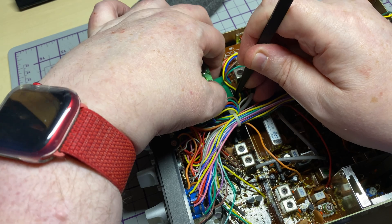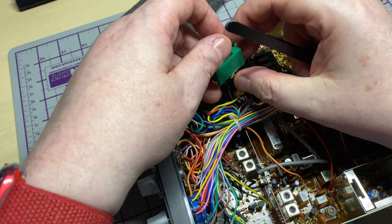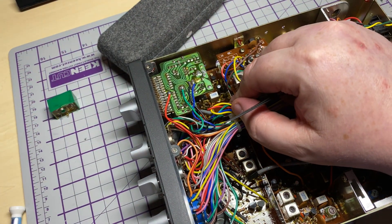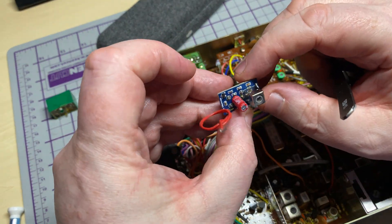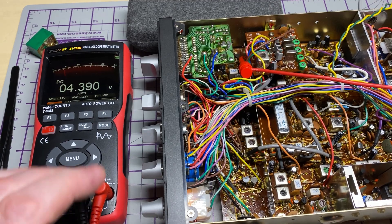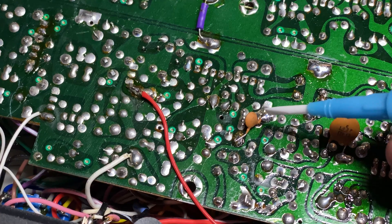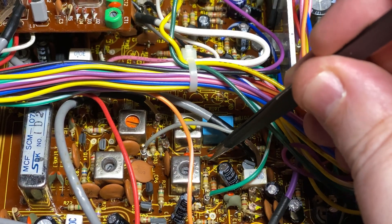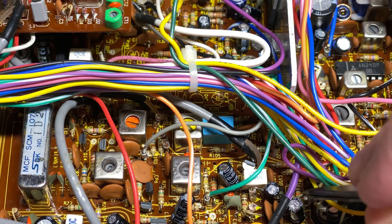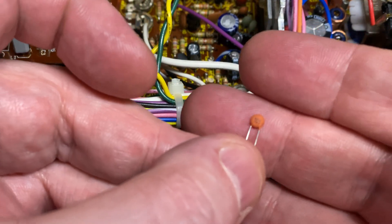The next job is replacing the VCO with a voltage-fed unit to improve stability. We could have just fitted a regulator to this but these VCOs have them built on, so we'll replace it and put one of these units in. Just quickly checking the VCO voltage across the bands and everything's fine. We've also added capacitance for improved audio and removed C99, replacing it with a 100 pF to improve SSB.